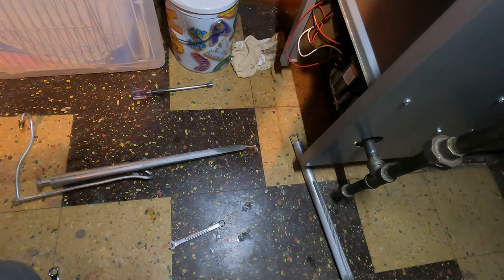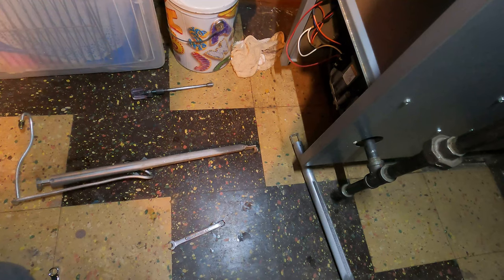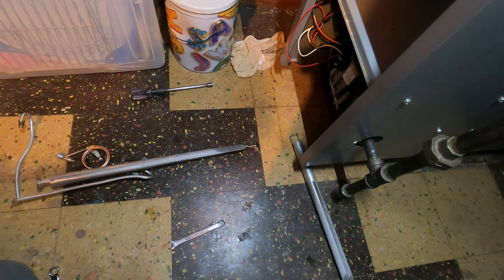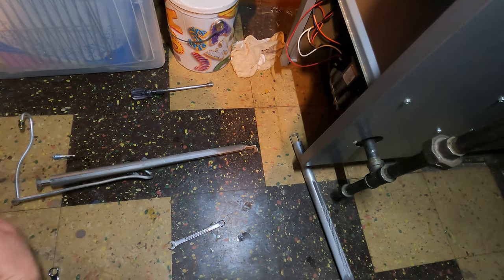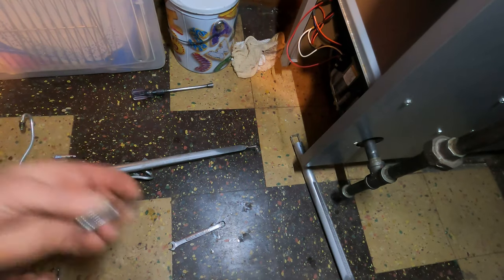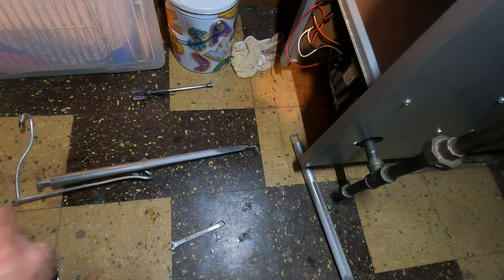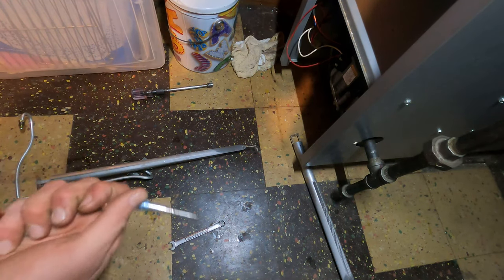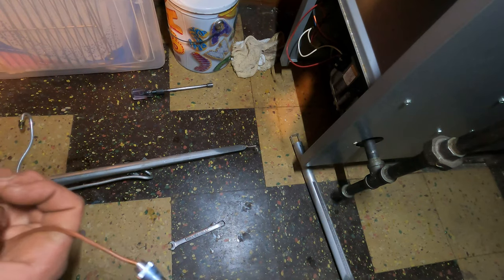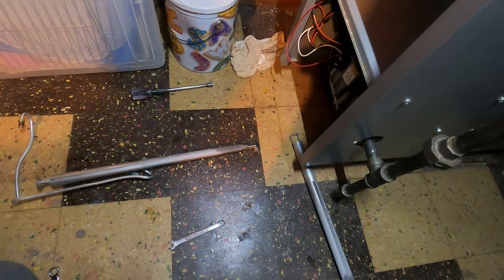Thermocouple. Now I won't need to use that top piece that whoever was here last time used. And it comes with, maybe not, unless I just threw it away in the box, but usually it comes with that little clip that somebody put up here. Someone asked, finger tight? Yeah, finger tight's all you gotta do. This side, you're just supposed to snug in enough because you need this piece to be sitting far enough in and making a connection with the gas valve.